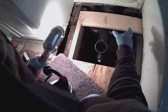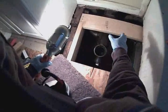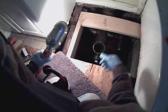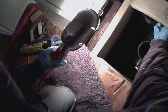Okay, here's the top side of this project. You can see where I've installed new braces. They are 2x6s. Normally you would install a 2x6 for support vertically, but in this application there's not enough clearance between here and there. It's only like maybe 2 inches more, if that. So I'm going to be adding another brace over here and another one attached to this 2x8.